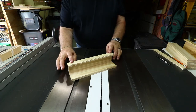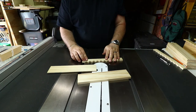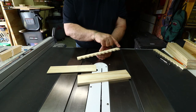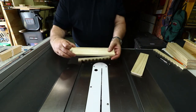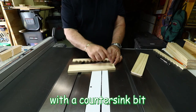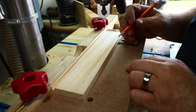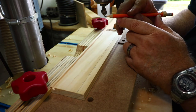My next step is to take this apart before any glue-up and sand all the flat surfaces to 220 grit — that's good enough for a display stand. Then I'll go to the router and round over all the edges on the upper support, into the holes, and on the front and side edges of the base. I'm using a concave bit to make the detents for the pen tips in the lower board. I set the depth so the top of the cutting edge is even with the top of the wood, which gives me a quarter-inch depth.